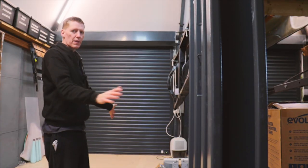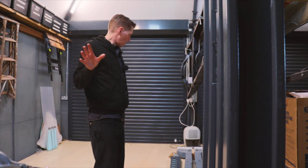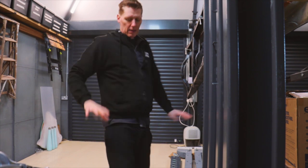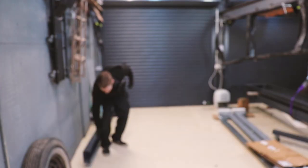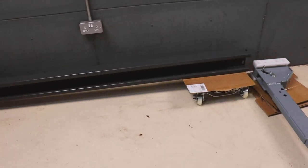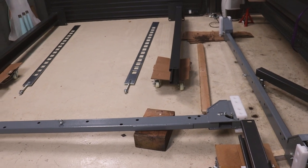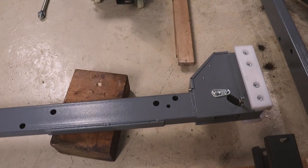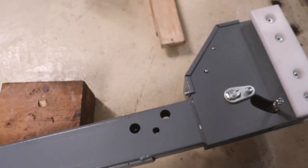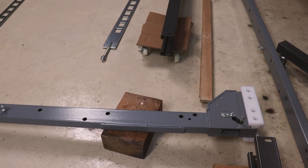The other half of the garage is now completely full of all the parts for the car lift. I've got the instruction video and I'll be referring to that quite a lot — brought my laptop down with the YouTube video they've provided. It starts with the four posts laid down on the ground. There is one special post which has a bracket on it that takes the controls, so that needs to go in a specific corner. I've got the four uprights laid down and the first cross member ready to slide into the uprights. You can tell roughly how wide this ramp is going to be — it's literally taking up half of the garage. There are wires at one end of the cross member that need to be near the control panel side.